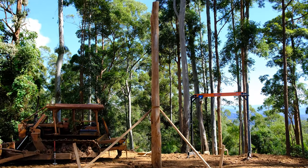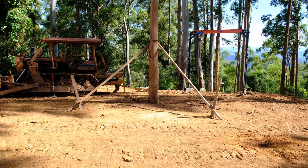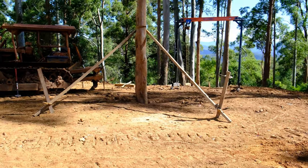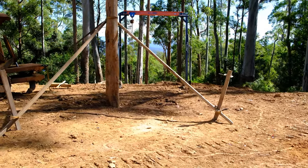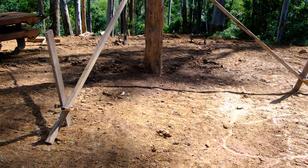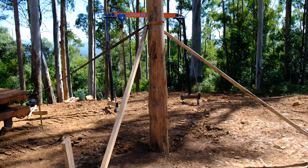And the pole itself can bow around a bit in between, but that's about as good as you can do it. I think so. And I think you've got to be realistic about the tolerances too, and the tolerances in this sort of building are probably plus or minus 2 inches. Yeah. Right, yeah, next step, put a bit of rapid set in the bottom and then we'll build the concrete plinth on top of that. Yep.